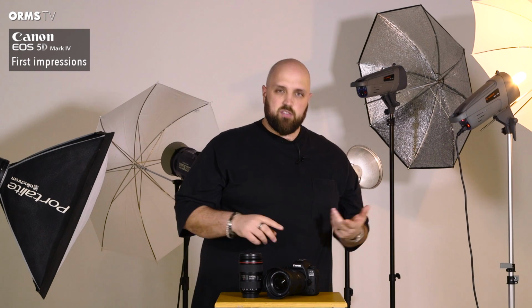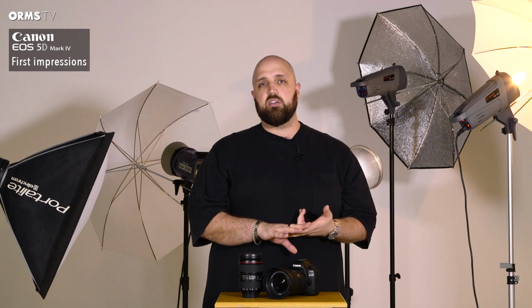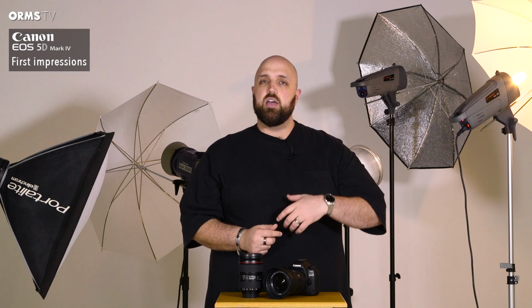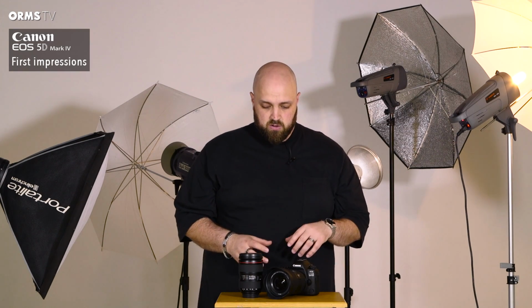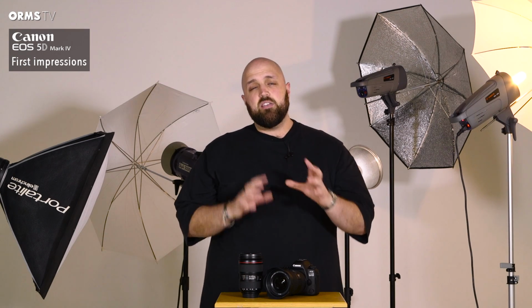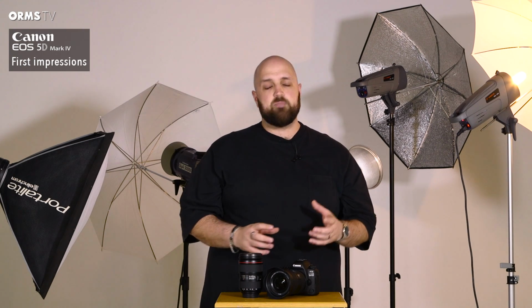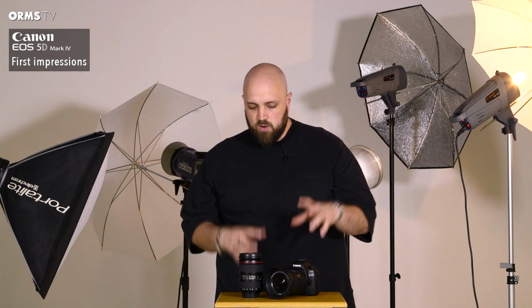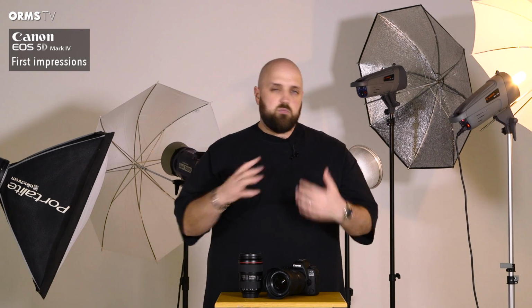So regarding the 4K footage, it's an 8-bit compression on there. It's 422 subsampling, and you're running at around about 500 megabit per second on your encoding. So that all seems very impressive. The sample footage that we've seen thus far, really good. No complaints on that. Again, when we get a full production model, we'll give you a proper rundown and we'll shoot some footage and show you guys what it actually looks like.